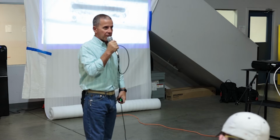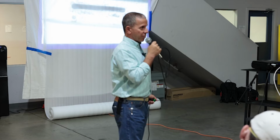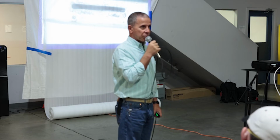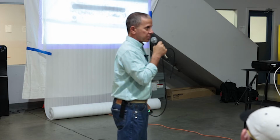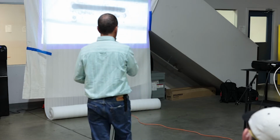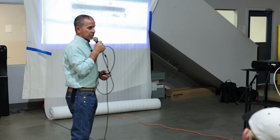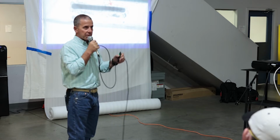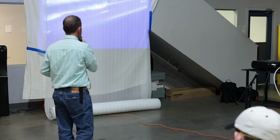And that can start, I've seen cases where this corrosion on this painted surface has started before the product is even put into service, because the paint coating is so thin there that it just needs some exposure to moisture to become an issue. So rounding these edges wherever that's possible before these structures are painted really makes the most sense, if you can do it.